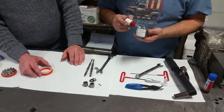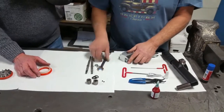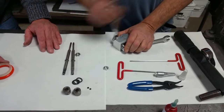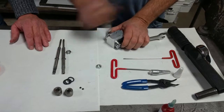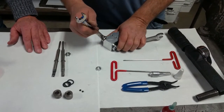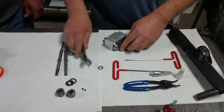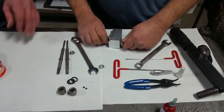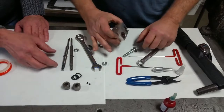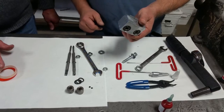Now we're going to put the other side in there, same way as we did the other side of the bearings. You're going to use the same little fixture and just run them down. You don't want to crank that down — just when it gets tight, that's when you stop right there. Now we've got them bearings seated against our spacer — if Dale remembered to put the spacer in that side — we've got the bearings seated against our spacer. We know our spacer is centered on the inner race of the bearing and everything's ready to go. Don't forget to clean your Loctite off — you don't want that in your bearings.